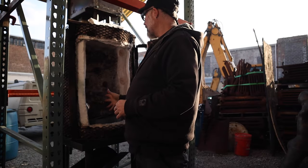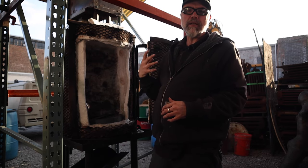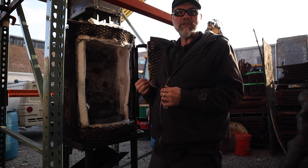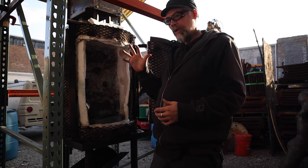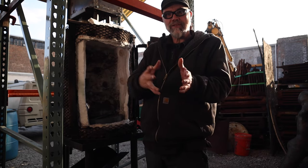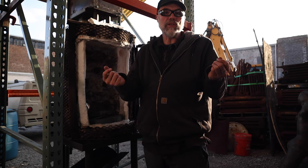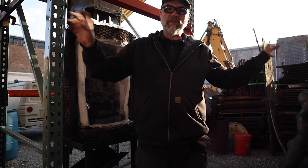You can see this volume is ultimately K-wool. I have put several layers of rigidizer — basically coating it with raw colloidal silica several times over the years — to help trap or encapsulate the silica fibers so they're not blowing around every time I turn on the burner. If you don't have any rigidizer or sealant on your wool, the internal pressure you're pushing through your burner into that volume is actually going to saturate through because the silica blanket is porous, and it's going to be launching airborne silica particles out of the exterior surfaces of your kiln.